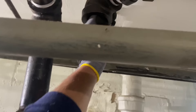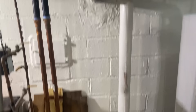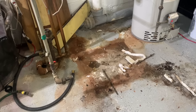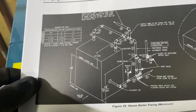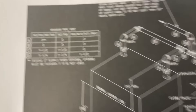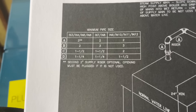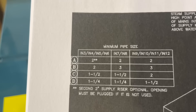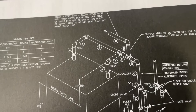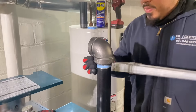When I was taking out the union the nipple came out - they just used Teflon tape, so we're going to make up the nipples coming down to feed the two headers. Steve's going to get some threading experience today on the threading machine outside. Let's quickly take a look at the piping diagram - it's on page 18. Let's talk about minimum pipe size. The second two-inch supply riser is optional - that applies to the IN3, 4, 5, and 6. We're going to plug the second two-inch supply riser and follow those directions right there to the tee, including that little drop header.